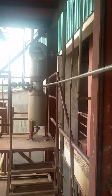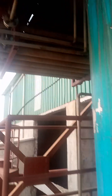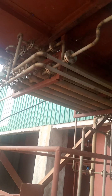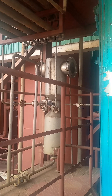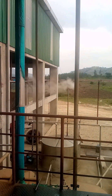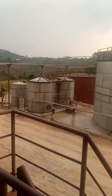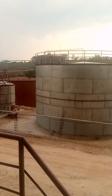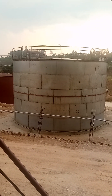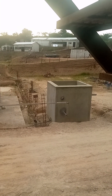The tank you are seeing over there is a decanter — a decanting system. Here are our cooling coils for the fusel oils, both low and high fusel oils. This is the bottom part of it. The other side is our intermediate storage vessels for both rectified spirit and technical alcohol. Here is the main storage tank for spirit, and the other side is the loading area for the spirits.